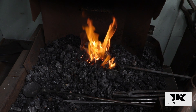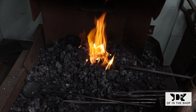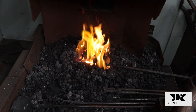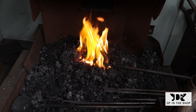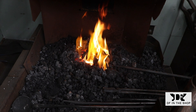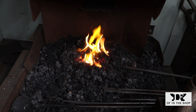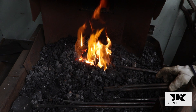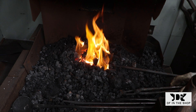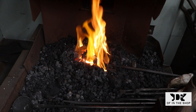You're going to notice that the bars heat up a lot faster in this heat because even though they may look cold going in, the core temperature is still quite hot so they're going to accept the heat very quickly. I've been spending the last couple of minutes slowly raising the temperature of the fire by cranking the blower a little bit and then easing up and stopping entirely at some point so that I can let the temperature equalize, following that cycle until I'm right up at the welding heat. It's a bright light yellow, there's barely any color to the fire or the steel, everything is the same temperature, and I'm ready to pull the bars out.